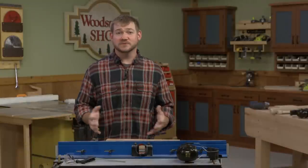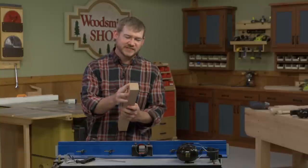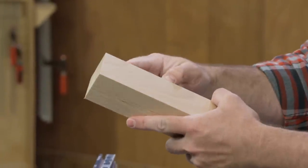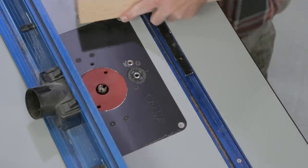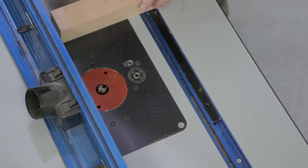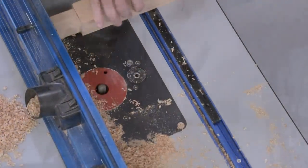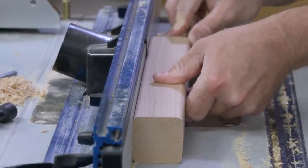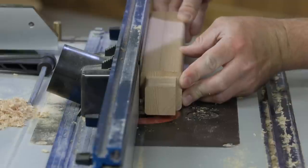Making the support arm is pretty simple — I have a blank glued up that's two inches square, and we made sure it fits inside the hole in the apron. We need to cut a shoulder to form a tenon on one end, which we'll do at the router table using a straight bit. I've set the fence to define the shoulder, make that cut all the way around, then nibble away the rest of the waste. Then we'll switch to a round-over bit to round over the four long edges of the support arm and the four corners of the tenon, going as far as possible towards the shoulder before finishing with a file.